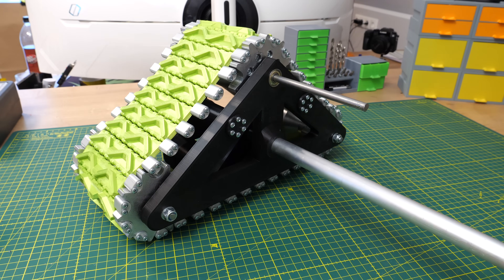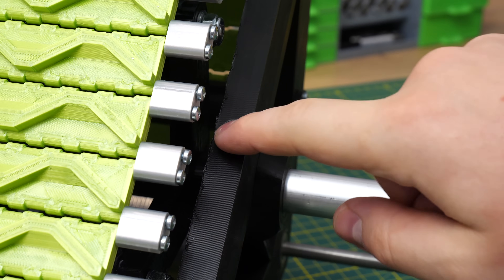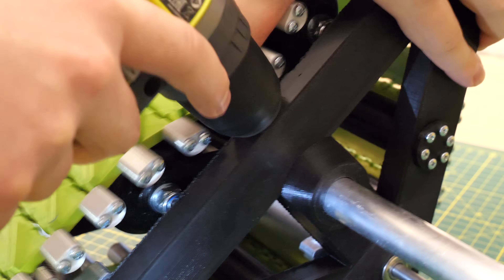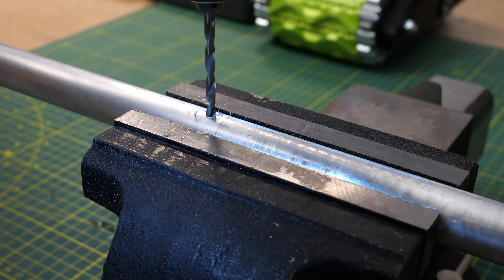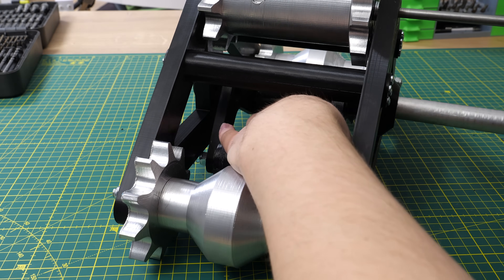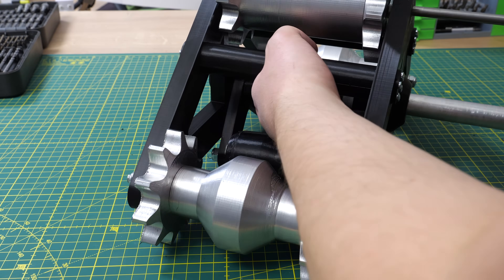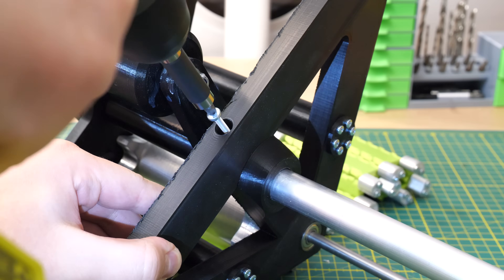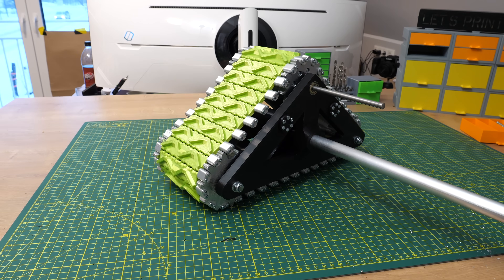Actually, I said it's basically done — there are two small things left to do. First, this aluminum pipe moves completely freely right now, so I have to drill two 4mm holes through that 20mm aluminum pipe. I drilled a 3mm pilot hole to avoid damaging the 3D printed hole, then drilled it out to 4mm. The second thing is to add the middle section — I just push the aluminum pipe through everything, then add the last M4 bolt to lock the aluminum pipe in place. It's done. Time to go test this outside.